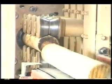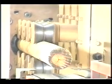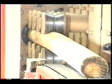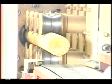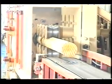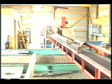On the RWS 8040H mill, the dowel size range is from an eight inch to four inch diameter. An optional head ranging from a four inch to two inch diameter is available for this mill. The RWS 6020H mill ranges in dowel size from a six inch to two inch diameter and will handle a maximum log of nine inches in diameter. The larger 8040H mill will handle logs up to a twelve inch diameter. Both of these dowel mills will cut up to two inches per side in a single pass.